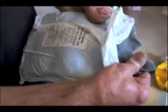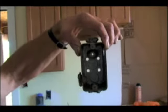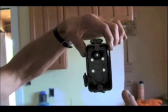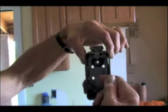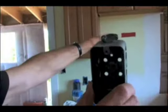There's this stuff here called duct sealer, and it's this gooey stuff, right? And it's used for sealing ducts in attics and things. And here's a typical electrical box. You can see the holes in there, right? So you stick this in a wall, you put an outlet over it, and you have all these leaks in here. So air goes through the outlet, through the plate, into the wall cavity, and possibly escapes through all those other holes, and then you have more heat loss.